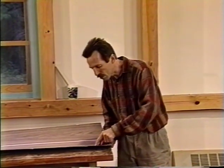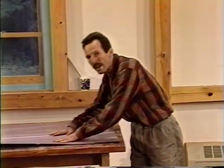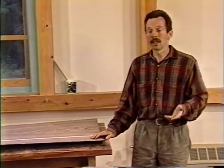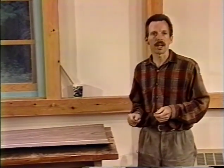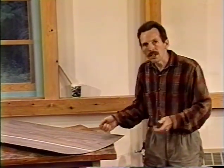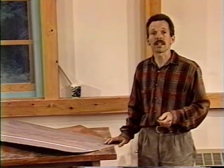Little bubble areas would show up. The other thing is, because this is fairly stiff, now I can pre-sand it in the flat, which is much easier than if it's on a curve, especially an inside curve. If you have a wide belt sander, you can even double sticky tape the leading edge of this two-ply to a sheet of, let's say, MDF or particle board and send it through. Saves a lot of time.